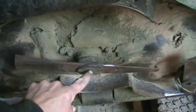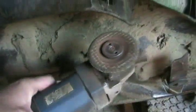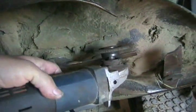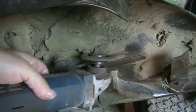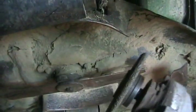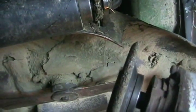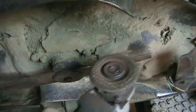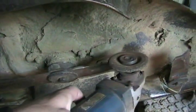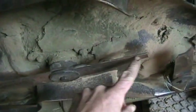Now of course you can just unbolt the bolt and sharpen the blades any way you want. But I'm pretty lazy. So if you take your little hand grinder, you get the backside of the wheel on it and go back and forth like this. Sure, it puts a curve in the backside of your wheel, but that shapes it just perfectly for sharpening your chainsaw, as a method I showed last year. Then you give it a few passes until it's all got the right angle back on it, and then just one little quickie along there to make the perfect knife edge.